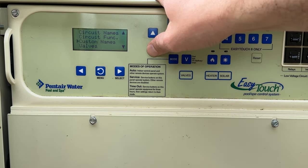Next up we have diagnostics. Inside diagnostics you can see the software revision and run a self-test. There's also a chlorinator section where you can check your salt levels — ours reads 3,350 parts per million. These readings are notoriously inaccurate and depend on correct water temperature, so don't rely solely on this; do your own salt level test using a Taylor test kit. You can also check water temperature, solar temperature, the roof sensor temperature, air temperature, and some resets.